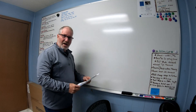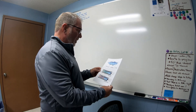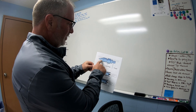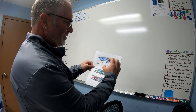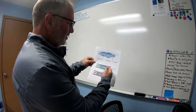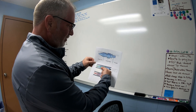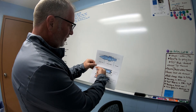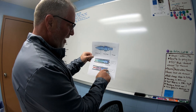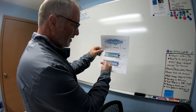So this here is a regular check ring tip — this is the screw tip, this is the check ring, and the threads that thread onto the end of the screw. This is the direction of material flow. When you're picking up material, you can see it goes around and underneath the check ring — there's a hole underneath where it fills through. Then once you start shooting forward, that check ring slams forward, seals off against the screw flight heads, and pushes the material forward.